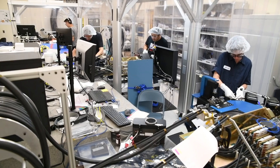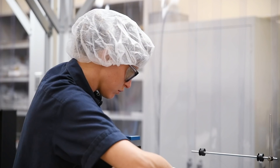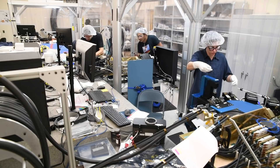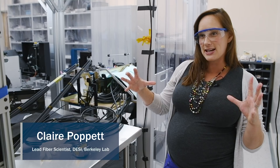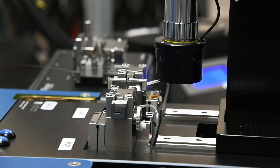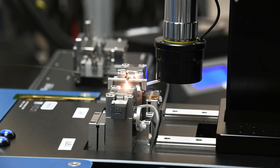In this room we have three different clean hoods, and under each clean hood we do the assembly of the petals and the splicing of the fibers to the long fiber cables. We use fiber splicing because we build the front-end focal plane system in one section and the fiber cable to the spectrograph split assembly in a separate section, then join the two together. The most efficient way to do that is fusion splicing — we expose the bare strands of glass and heat them up in a very precise way to make that connection without any losses in optical quality, throughput, or degradation of the light.